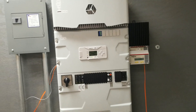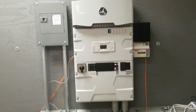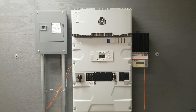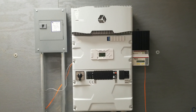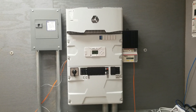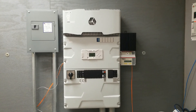What excites me about this is, unlike the inverters which we purchase, it's rated at 4 kilowatts and you get exactly 4 kilowatts. Unlike other inverters, the 4 kilowatts they tell you is at 25 degrees C — that's in the lab, totally meaningless for us in Nigeria or in warm countries. This is rated at 4 kilowatts at 40 degrees Celsius — that's 104 Fahrenheit.